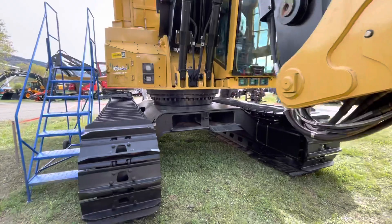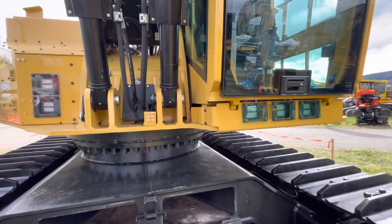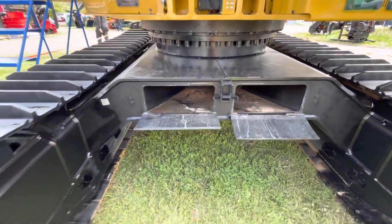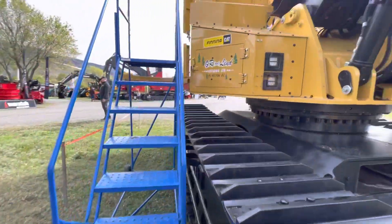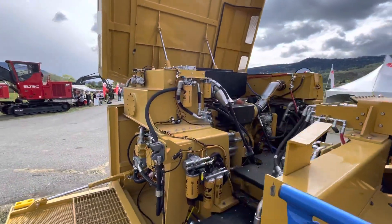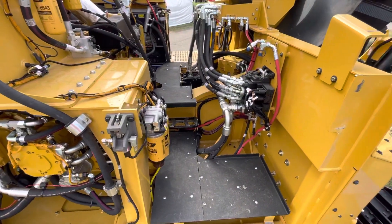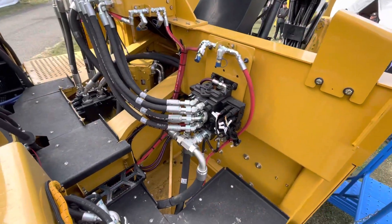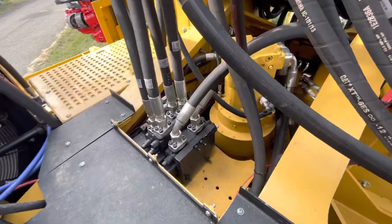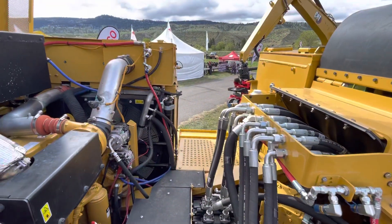This machine should really have a 24 or 27. I was fairly impressed with their layout — there are a few little things that seem a bit hokey, but other than that, tons of room, valves are separated, easy access, one massive swing drive. They sit at something like 92,000 pounds of swing torque.